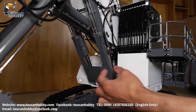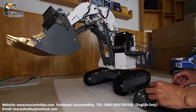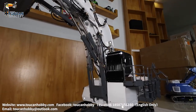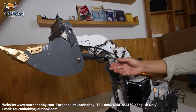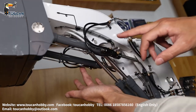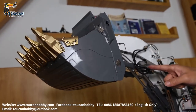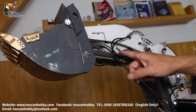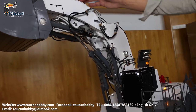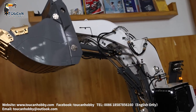On here, two cylinders for the big boom with a protection plate. Also have two cylinders for the front arm, and two cylinders for the bucket. On the two bucket cylinders, have two pressure release valves. So for the bucket moving when you're digging, you can adjust the two-cylinder pressure less than the manifold pressure, so it can operate the big arm and front arm with more power, and the bucket with less power — more smoothly, protecting the cylinder for the bucket.